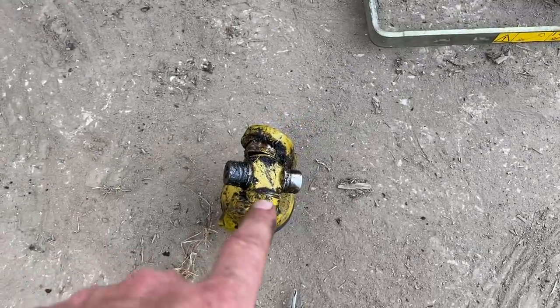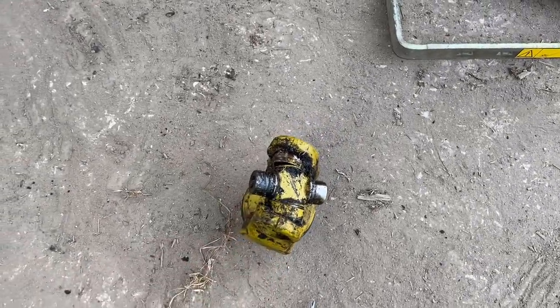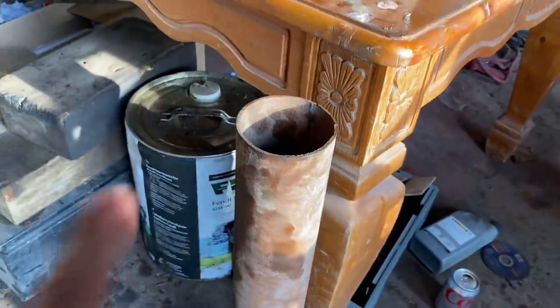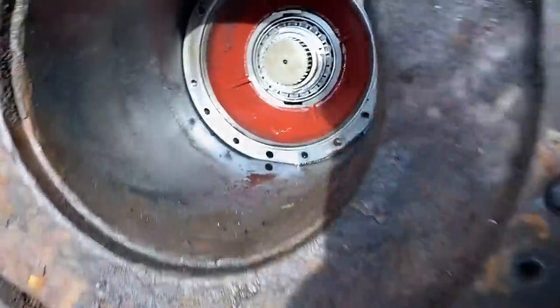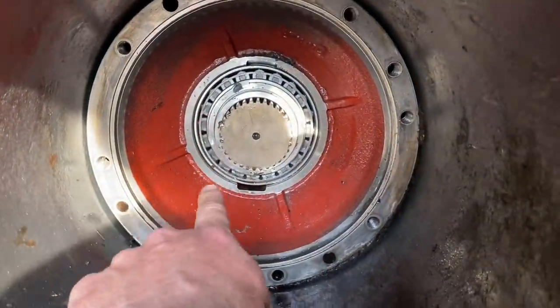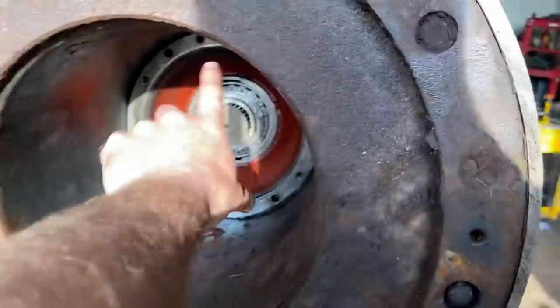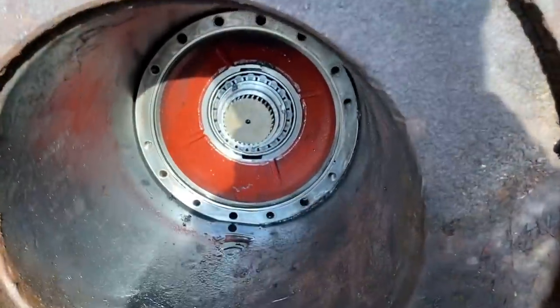Just when things were going wrong on the mower, something else goes wrong - usually comes down to a drive issue. We've got this big bit of tube and we've got to weld some teeth on it so we can grip it on that nut inside. We'll make four teeth, put a bar through the end, and see if we can turn and undo that nut, pull it out, and hopefully there's a seal behind it that's gone that we can fix.